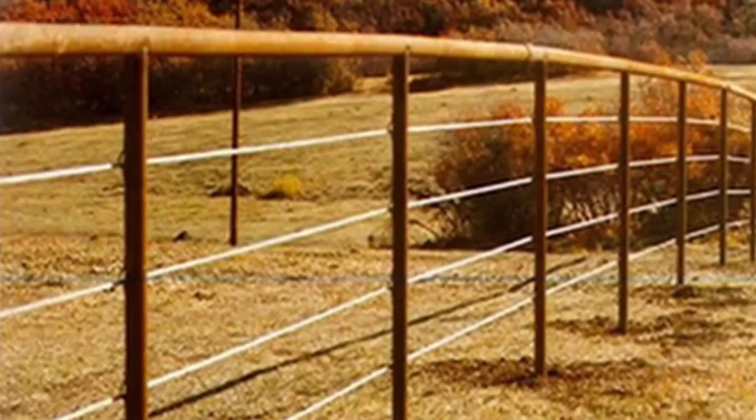Because of their expense, cable fences are used primarily for confinement areas such as holding pens, feedlots and corrals. Cable fences consist of steel wire cables stretched from one anchor post to the next. There's no limit to the number of cables used, but a six-cable fence is typically used for large animals. Spacing between the cables depends on the type of livestock being confined.